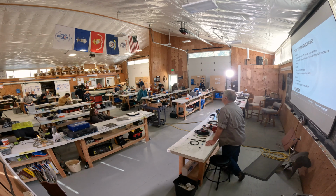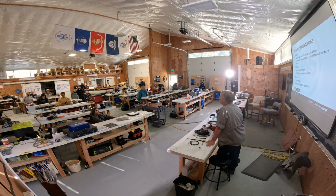Now let's look at the driver and say, well, I've got a 35 horse Yanmar with this boat, and I'm going to do a Balmar alternator, a Wakespeed regulator, and their belt and pulley kit. All the ratios are already figured out for me, it's great, they did the hard work.